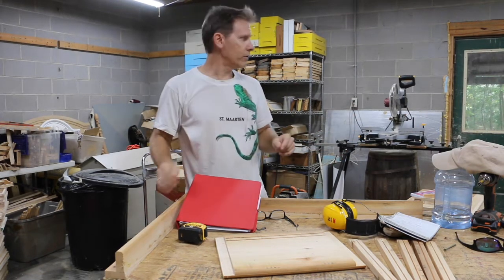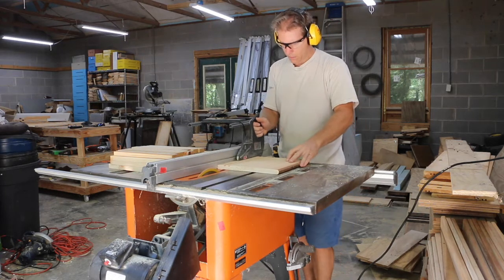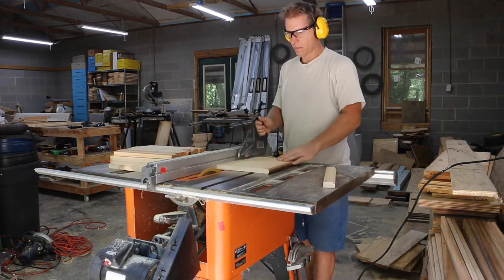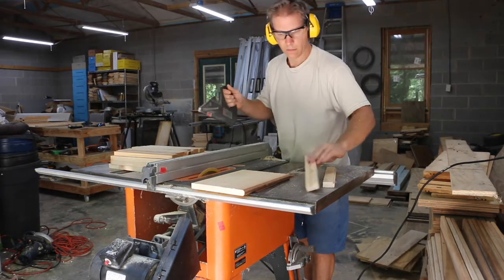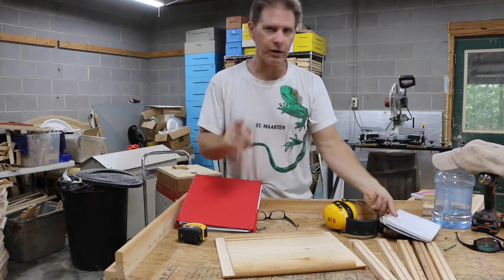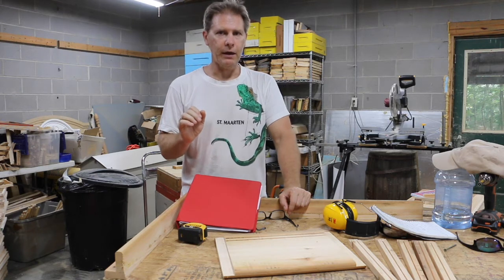When you're building boxes for bees and you want them to stack nice and tight on top of one another, you don't want any wobble or gaps — everything needs to be square. I've seen cheap table saws with nice fences, so don't buy a saw unless it has an accurate fence. Sometimes you can upgrade and get a new fence for an existing saw. I struggled for a long time with one particular saw because the fence moves, so I have to take a square, line it up, then make my cuts. A saw doesn't have to be expensive, but an accurate fence is a game changer.